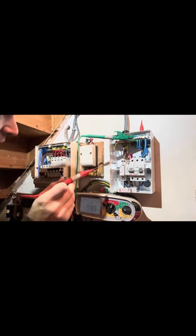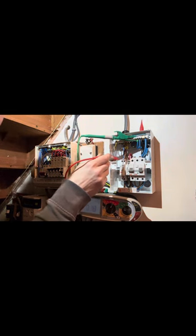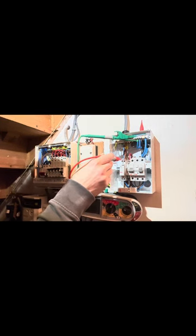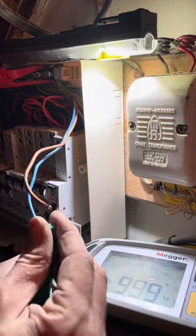All good. There is a neon on the old shower - there's a pull cord isolator thing which is why I've got that reading in there. I'll go turn it off and redo it, but I'm just going to go ahead and flick the switches. I'll flick all the switches - not commonly done by people, but in the moment you switch on, if you flick the switch it'll highlight the issues anyway because it'll bang out if there was an issue.